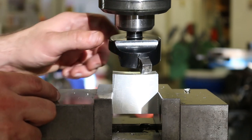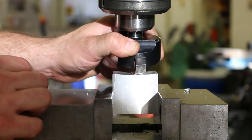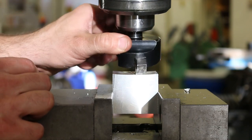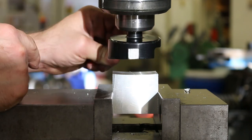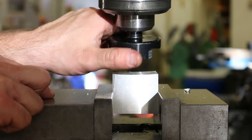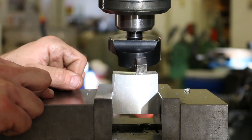If it's off at an angle like this, then it has an apex when it's in this position, and then as it gets in any direction, either this way or this way from that apex, it actually moves further and further away. And when it's at its 180 degree opposite point, it's at its furthest point from that surface, right? And that's why it cuts that concave surface.